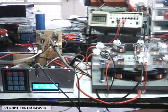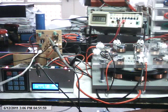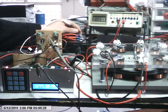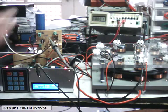Now I can still go to the negative end of the battery as long as I stay above the supply rail. Here I have a 32 volt Zener diode, so I will stay 30 volts above the potential of the supply, and I will short it out to negative supply, and you can also hear it increase in speed. Okay, and I can feel the diode getting hot in my hands too. That's about hot enough, I'm afraid.